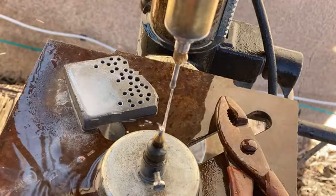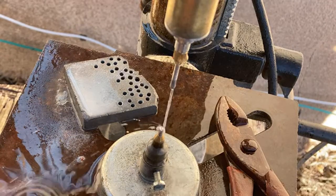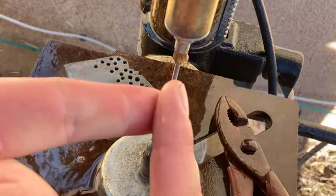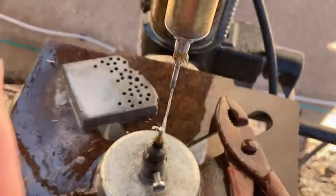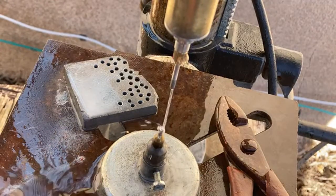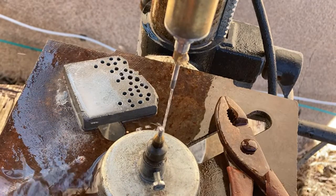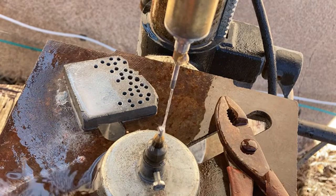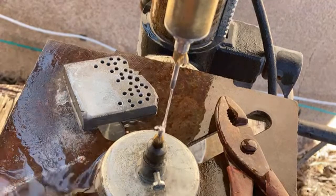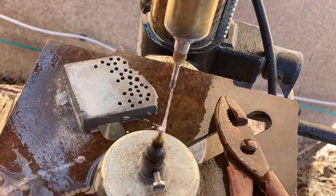So, put it this way, anything that is too hard to drill by hand is pretty much perfect for the Gunther drilling system. This drills agate, quartz, jade, like butter. As fast as you can pull that handpiece down on your drill press is as fast as it's going to drill. But I would avoid softer stones like chrysocollas, malachites, some cheap stabilized turquoise, lepidolites, and really mineralized stones. However, I have done those stones on the Gunther when I needed a precise hole.